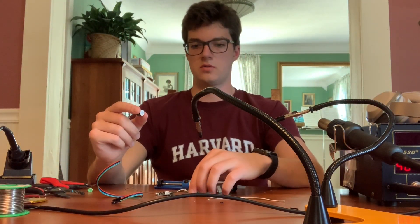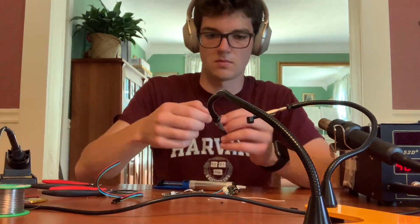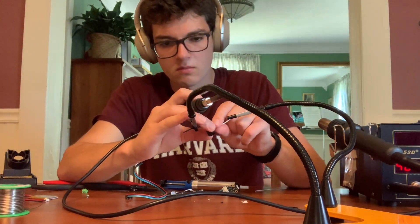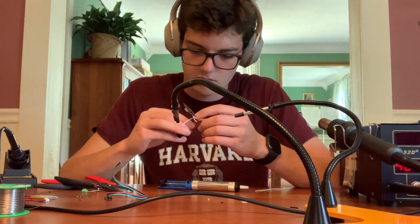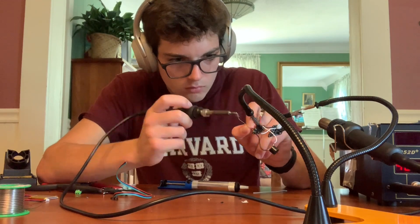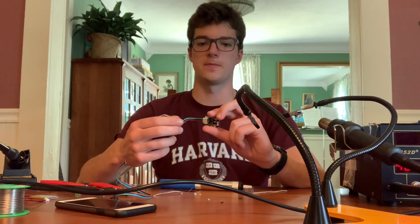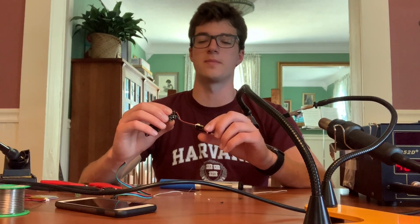The last thing I need to do is connect the buzzer to this little assembly. I also remembered that the lightning sensor has an interrupt pin labeled IRQ on the board, and we need to connect that to a hardware interrupt on the Beetle. There are conveniently broken-out RX and TX pads on the back that I'm going to connect it to — the RX pin is pin zero, which is an external interrupt, so that's going to be the one.